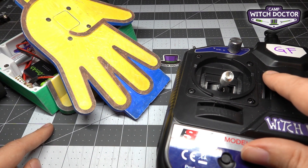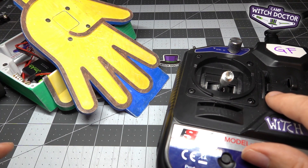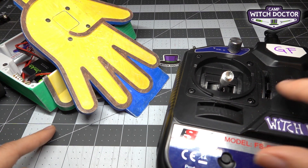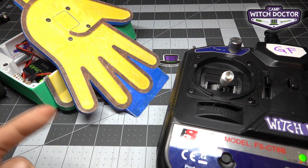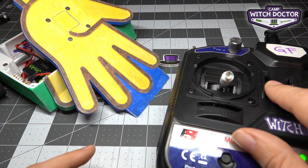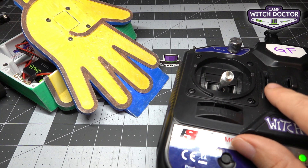If when you turn on your robot you hear that it makes a certain sound, that means that the servo horn is actually hitting something inside your robot. This could drain your battery faster, so we don't want to hear that sound. In this case, it's because my trim is all the way down. So if I adjust it up a little bit, you can see that that sound stops. This is the lowest that I should have the arm — you should never have this sound all the time. It's okay if your robot makes that sound when you have another robot on top of you, because it's normal for the servo to be doing a lot of work.